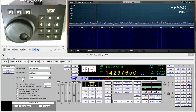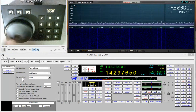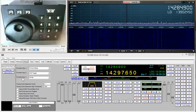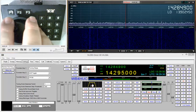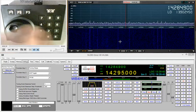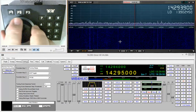If I select function key 3, now when I turn the knob you'll see VFOB is tuning the external receiver while VFOA isn't moving. If I go back and change the knob to control VFOA, then VFOB isn't moving. This split mode is really handy when you have an external receiver like I do, and you can use it for split chasing DX, operating split, or however you want to use it.